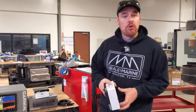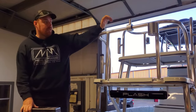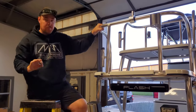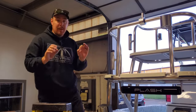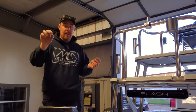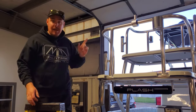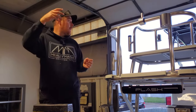So a quick rundown of what we're going to do: we're going to mount the 1243 right here. We have this mount with another piece we're going to figure out — it's going to go here. Then we're going to run the wiring through the tubes so it looks super clean. I'm a little nervous about that — I've only done it a couple times. The biggest thing is those network cables from Garmin are ginormous, so we're going to have to cut one end and use the little kit to build the cable. We're going to run the network cable and the power cable back to the console and network everything there.